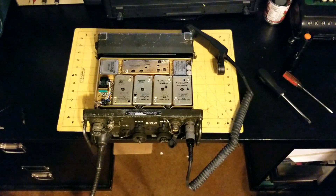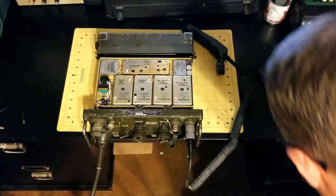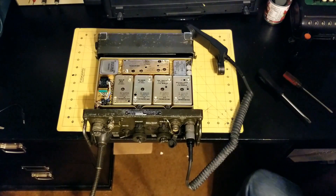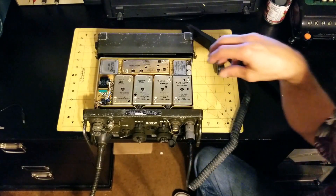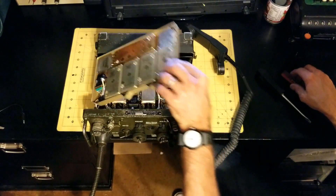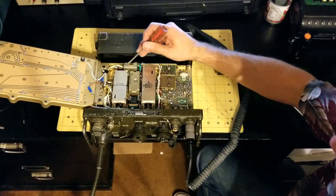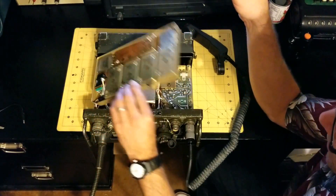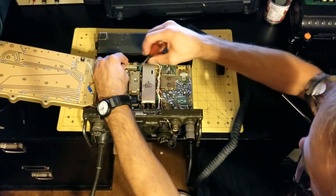Through process of elimination, I've done some testing with the GRM-55 test set and I've also started replacing some suspect modules to try to identify which module is bad. I've finally concluded that the transmitter mixer, which is module A50, underneath this hinged circuit board, is the offending module.